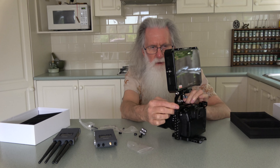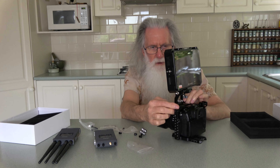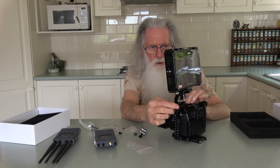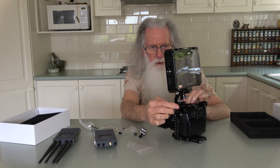That's all what's in the box — another set of units, no HDMI cables included. I'm looking at getting the flexible type they use in quadcopters, but they don't really have shielding on them and I don't know how well insulated they are from electrical interference. As you can see, for me it's just not a matter of pulling them out of the box, putting the battery on, and off you go — mounting is a problem. The HDMI cable in the monitor, if you remember, had a curve as big as your hand. That means it has to come down, but the HDMI cable has to fit between the gimbal motor because that's shoved right up that way.